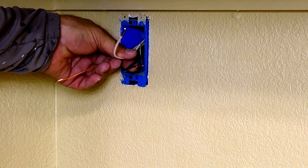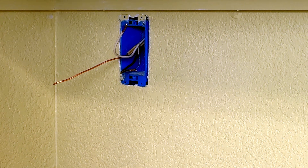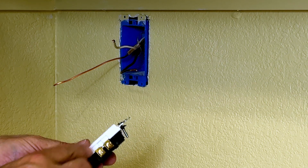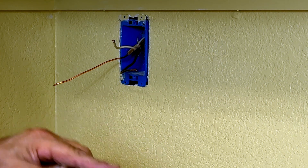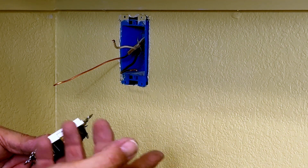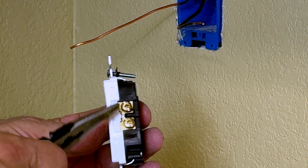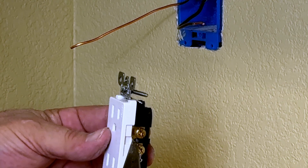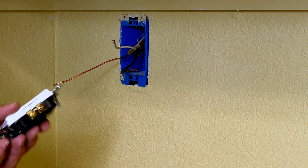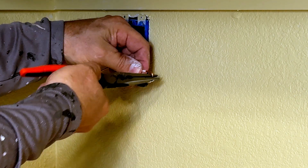This is the very end of the chain, and you'll know that because you only have one set of wires — you're not carrying on to another plug. You're simply going to take your plug. You have two spots on each side — two for hot, two for neutral — just like the others, but you're only going to use one. You can use either one; it doesn't really matter because it's connected through this little tab here. Now you could take that tab, grab a hold of it, break it off, and make this two separate circuits — but we don't want to do that. We want to just feed them both and bend them around.